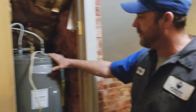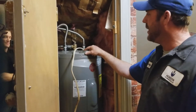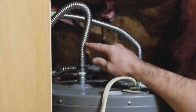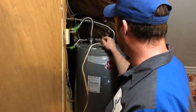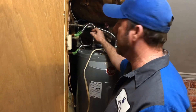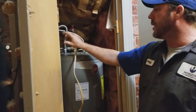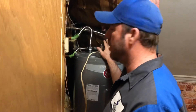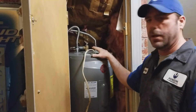The first thing you do is turn off the power. Check it — make sure you don't have power there. You're going to install the unit on the hot side inlet. It's going to go through the device and then out to the fixtures, or wherever the demand is. The wiring for your unit is actually going to go into the device, and then the device comes with a whip — another piece of wiring that goes from the unit back to your heater. Now the device controls the power to the unit. So when the unit's not in use and you're not using hot water, this unit is going to keep the power on to the tank just like normal and heat the unit like it's supposed to.